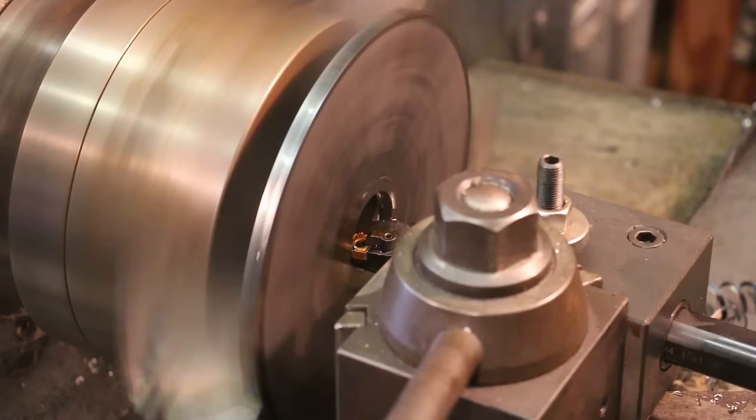So now the disc, this is a dividing head. This is the Kearney Trecker dividing head that these will all go on. And basically, this disc will fit right up on that little boss in there. It fits in this sleeve. The original here has three screws that this will screw in place, and then you tighten it up. There's a little clamp or a ring around it that tightens everything in place. And I checked them all out, they fit great.